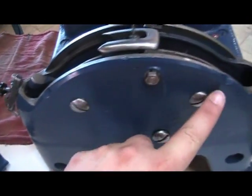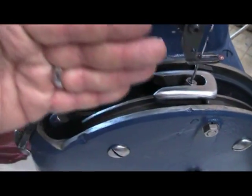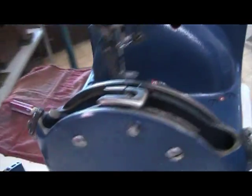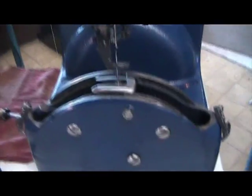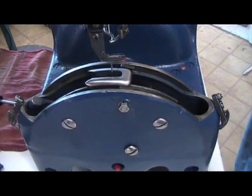In this case, we're in alignment already so we're not going to change that. After you've set the top alignment with these screws, you need to set the bottom tilt. These screws adjust the position side to side in the machine, and you try to get it perfectly on center. This screw adjusts the tilt — in other words, the angle of that needle as it interacts with the parts. When we set this, we want it in a natural position. Turn the machine over with the hand wheel a few times to make sure the needle and awl are traveling well and not binding, and let the machine naturally set the home position for that needle action.